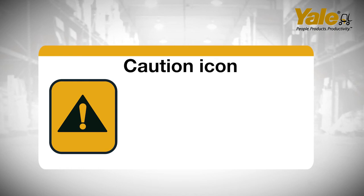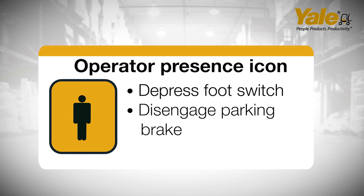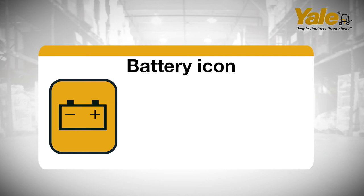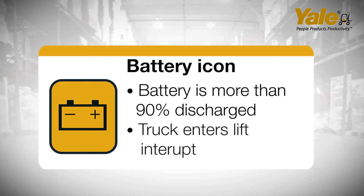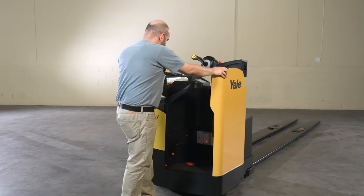The operator presence icon indicates if the foot switch is not depressed or if the park brake is applied. A thermometer icon alerts you if the motor or motor controller is not within pre-programmed limits. A wrench icon is displayed if there is an active fault, and a battery icon appears when the battery is more than 90% discharged or if the truck enters lift interrupt. For extra security, up to 100 unique five-digit passwords for operators, supervisors, and service technicians can be stored within the system, limiting truck access to authorized trained personnel. The enclosed end rider also has counters for traction, lift, and total truck hours.